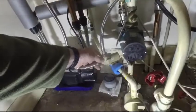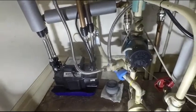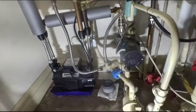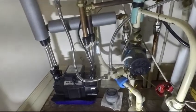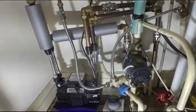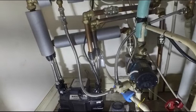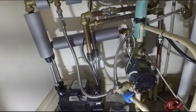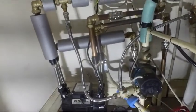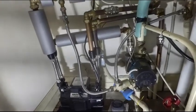There's a concern over these pumps — they've never actually had any problem — but the concern is that it's just a plastic pump body, so if it fails, you could have a catastrophic water leak. So it would be nice to have a more robust pump. Also, it doesn't have the power to destratify the cylinder fully when it's getting near to fully hot. It can maintain about a 9 degree temperature difference between top and bottom, with the top running at 60 or so degrees centigrade. It's impossible to get the bottom any further up than about 51 degrees. So as a suggestion, at least, of trying a more robust and more powerful pump to replace this one.